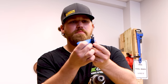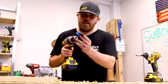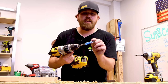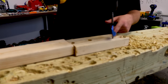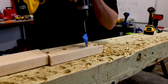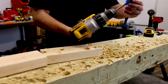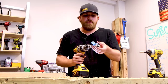Wrap the piece of tape around the spade bit and that will give you your depth. Let's say you need to set some type of anchor in the wood, but you need an exact depth of a quarter inch or three-eighths of an inch — you can mark off where you need it, set your tape there, or draw your line. We'll just drill to the edge of the tape and we know we have our correct depth setting.